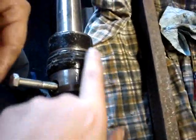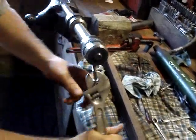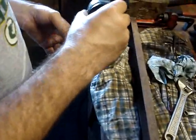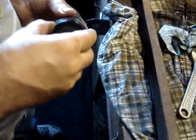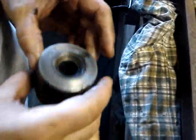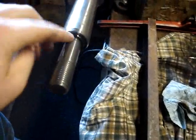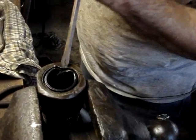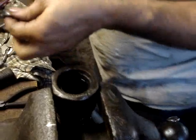We've got this in the vise and now you've got to get the seal out of here. This thing is threaded on the end, so you just stick a bolt in this hole. Your seal is just on there and then there's an O-ring on here that seals it. You can slide this off and there's a seal inside the end of that. There's your seal — and you've got to take out your snap ring.